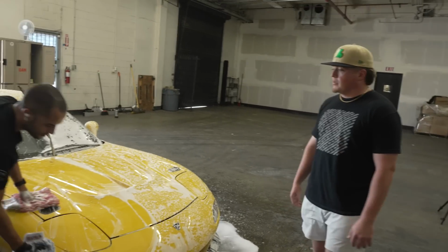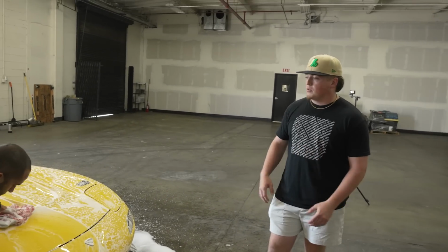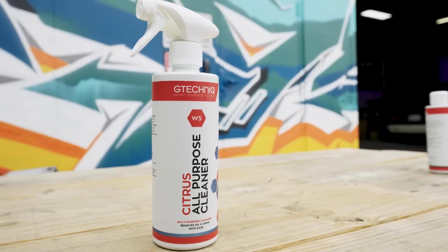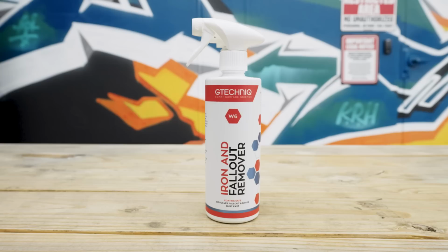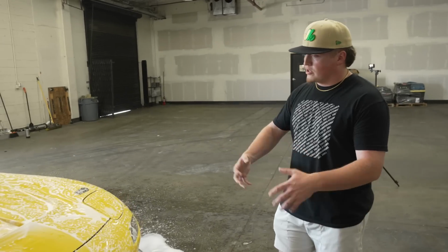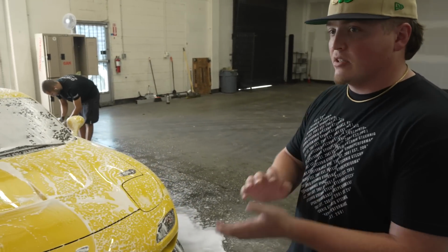Every 6 months, typically, all of our accredited installers, you want to have it refreshed. You can also do it yourself. It's a very simple process. First, you spray W5 and you let it eat for 3 to 5 minutes. Spray that off, then you'll spray our W6 on the surface too. And then once you've done that, pretty much your coating is going to revive. It's going to pull everything out and back to the surface like it's brand new.